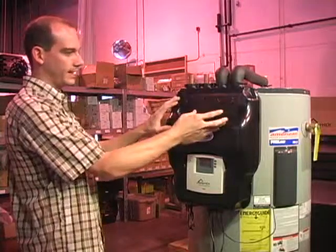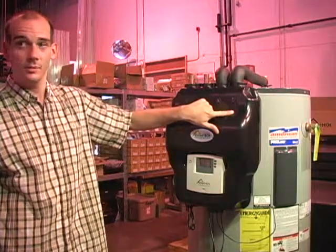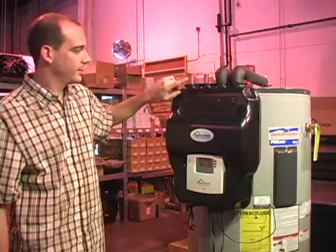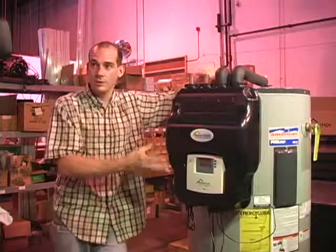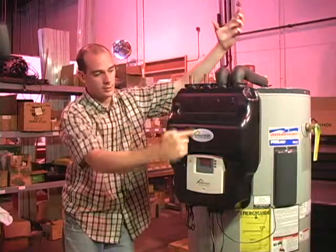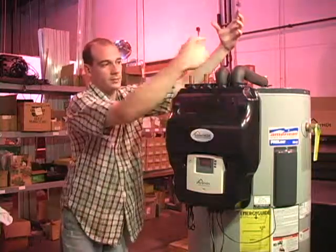Across the front there's a guide you can use when putting one of these in. You've got your "to storage" and "from storage" connections — pretty obvious which goes where. On the storage side, this is your cold and this is your hot. On the other side, it's going to your heat source and from your heat source. On a drain-back system like this one, the drain-back tank is on the "from your heat source" side. I visualize it as both sides moving clockwise — so both loops are going in clockwise rotation.